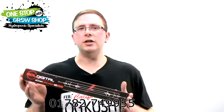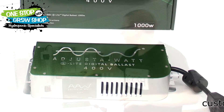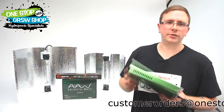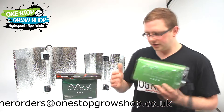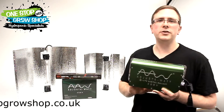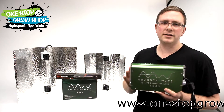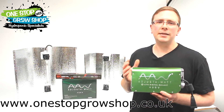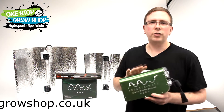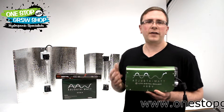Or if you're struggling with heat, turn it down to take stress off your plants. Then there's the ballast — not only is it compact and it looks good, but more importantly it's got some funky features. As you can see, it has two inbuilt fans. These have been sourced to be quiet and efficient — it only really needs one of the fans to stay within working parameters. The really nice thing about this unit is the inbuilt thermostat that controls the fans, so if they don't need to be on, they won't be.